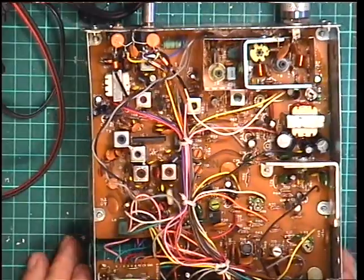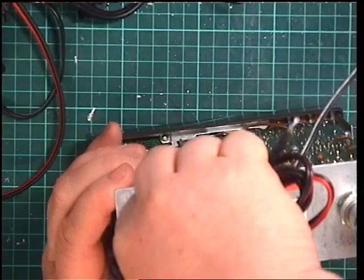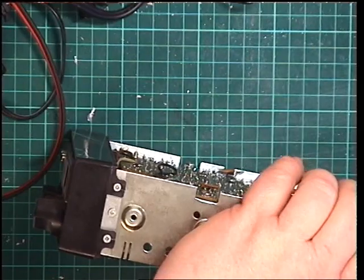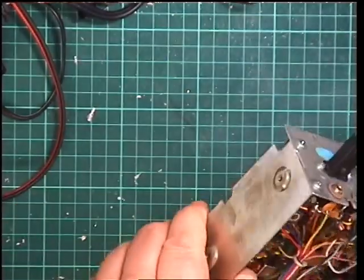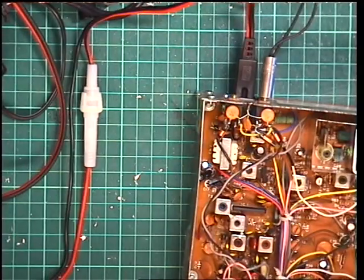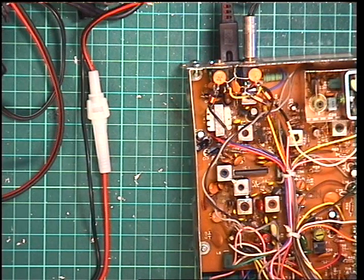So looking at the radio on the inside, I can see that the red is to the left. Now here we go over to auto radio on the background music system. That is too tight a fit. So I'm going to have to be very careful putting this in. So what I've done is to hold the connector from this side rather than just forcing it in. It has gone in. It's very tight on the pins. I think there would be a tendency to possibly break the socket if you repeatedly put that in and out. So we'll connect that up to the power supply.